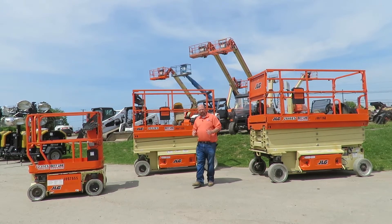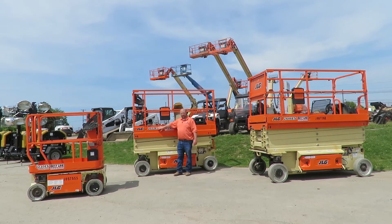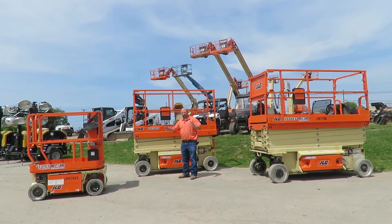So what we're going to do is take a look at these and learn a little bit about what the different heights and widths mean. For example, on this machine here, this is a 20-foot high scissor that's 32 inches wide. The reason that's important is, let's say that you need to get up 25 feet — the thing to know is: do you need to reach that 25 feet with your feet or with your hands?